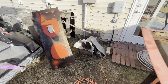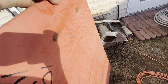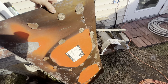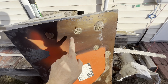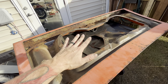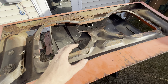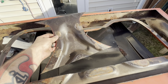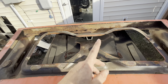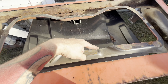So here's what we're left with. We cut this piece out of the center — there's a lot of weight right there. We pried the edge up and pulled it off; from the factory it's just glued on, not welded. It's glued to your inner structure so it doesn't vibrate — you can separate it just like a door. Then I came in here and cut the center out of the inner structure too because we may put an access panel in there.